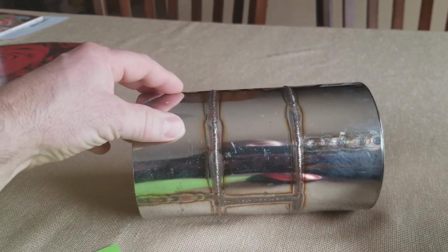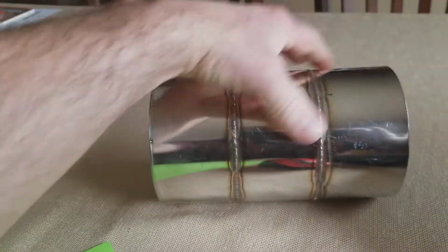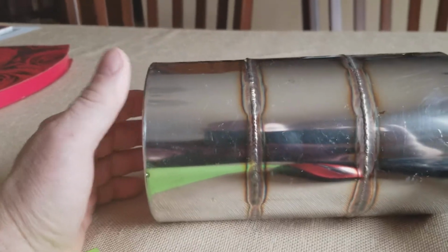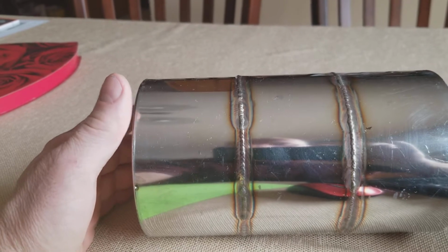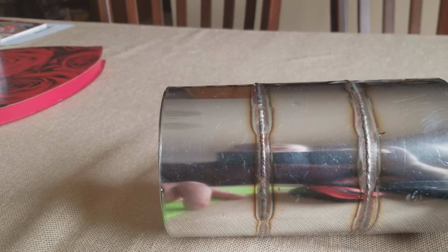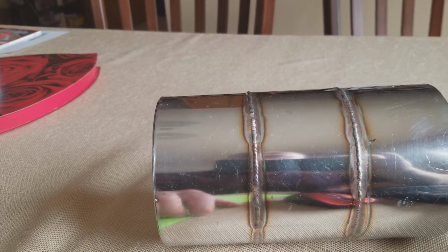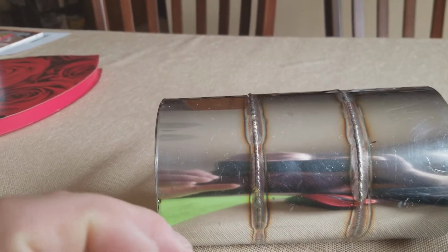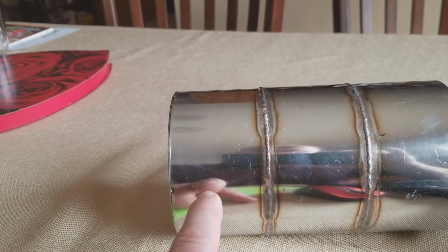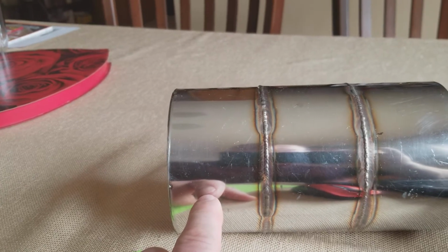that's what happened. So the first thing I did was I had the drum on the opposite side of the seam, and the drum was chained down on some V blocks. So what I did is I took a 2-inch 4 flute button cutter, or a round insert cutter, and I brought it right to the center of the drum.